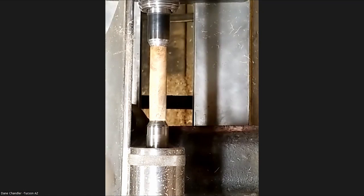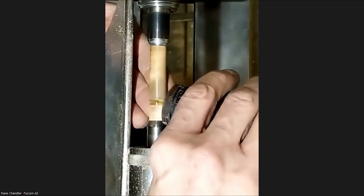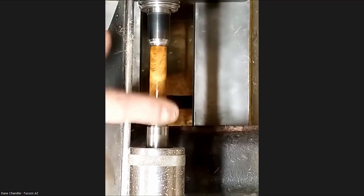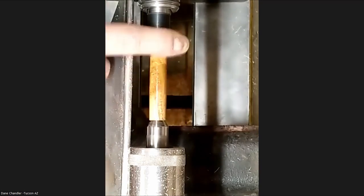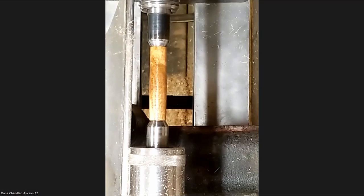And I got to ask, did I use sandpaper? Let's put some oil. I didn't see it. How'd you do that? No sandpaper? There's a little bit of linseed oil. So I actually got through it with fewer iterations on the skew to where I didn't have to go sharp. But that's also akin to the tool material. Looks beautiful. But normally what I would do, I would have sharpened, like I was saying earlier, before I did my final pass. But I knew I only had a couple more to go, and I knew the tool would leave that surface that I'm looking for.